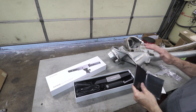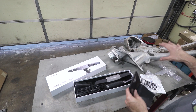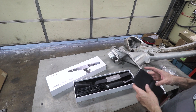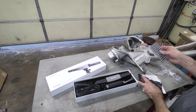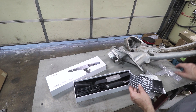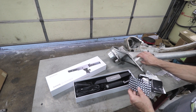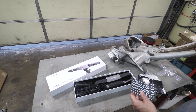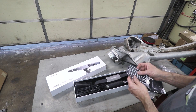The instructions say you want reflective surfaces, which is why I cleaned these somewhat. It does not scan black very well, so we're going to cover the table in black, and if we need to, we can add these highly reflective markers at various places along the length. This part here is pretty distinct — it's got a lot of features. But sometimes you need to track where you are in parts that kind of look similar, so it may need some markers on that area. We'll play with these little dots and see if we need them or not.